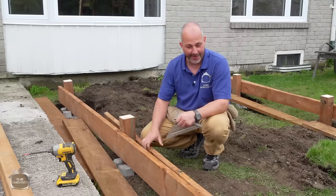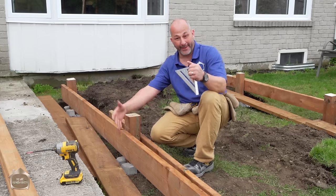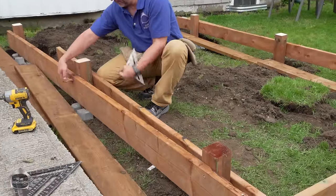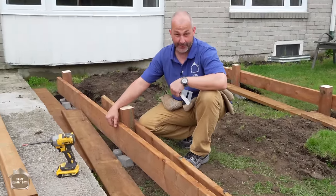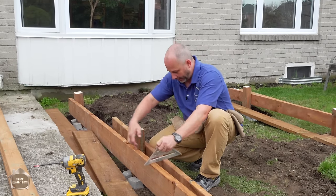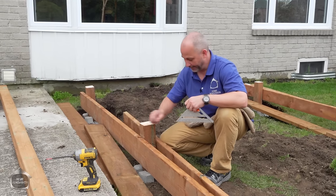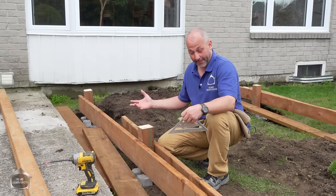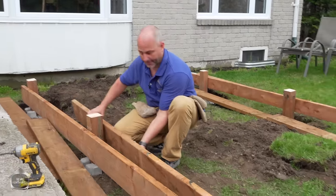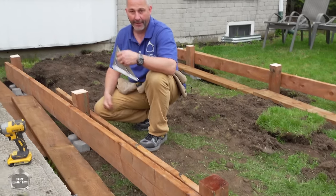So when you're building your box beam, the idea is to have a 4x4 post and then 2x8 lumber or 2x10 lumber, depending on your span, sandwiched like this. Okay. And then we drill and we put in a galvanized bolt that carries thousands of pounds of weight. And the concept here is we'll have just a load transfer. So now all the joists sit on top of this, transfers over like this, like a carrying beam, down the post into the ground, and that takes care of all of our structural load. And if you have a really, really long beam and you got to meet in the middle, you can just attach a board at the end, once it's squared off, and use it as a measuring stick, and then just mark where the middle of the post is, and then cut it there. Piece of cake.